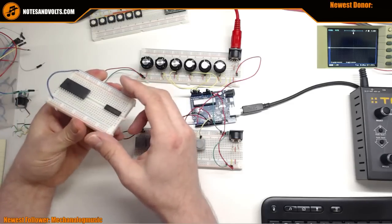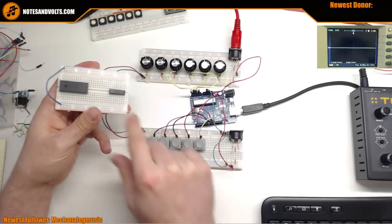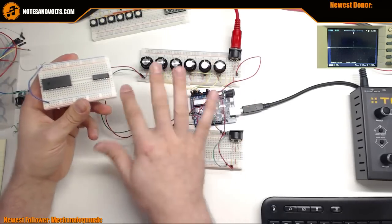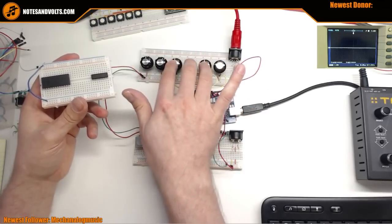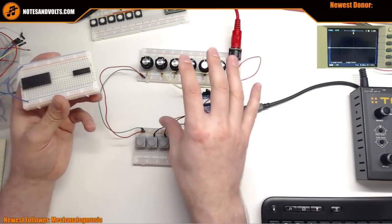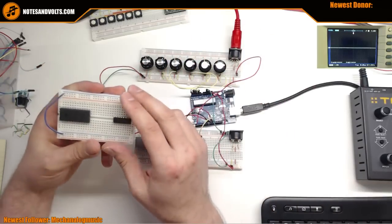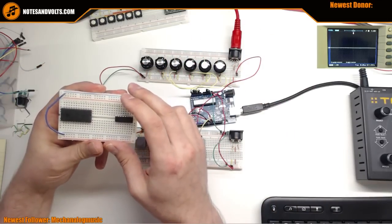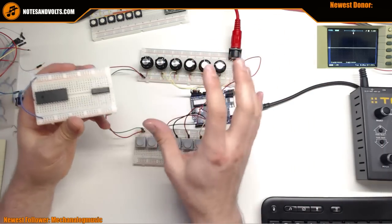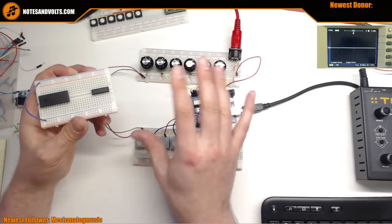The plan is to use the 16-channel for buttons and the 8-channel for pots. In this setup, pots take longer to process than buttons. The more stuff you add, the longer it takes the code to scan all your controls, so if you go crazy with pots you might start missing readings. I haven't fully stress-tested it yet.